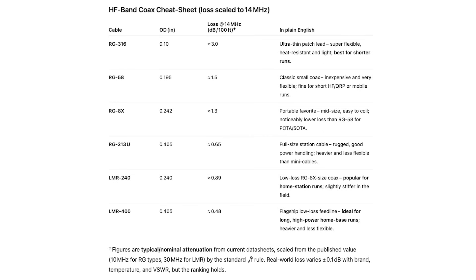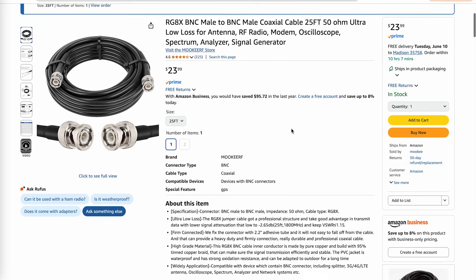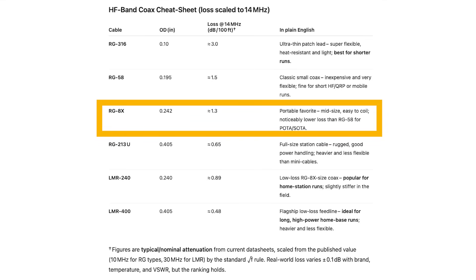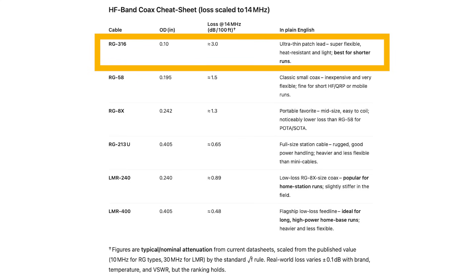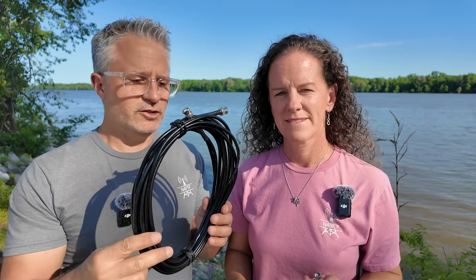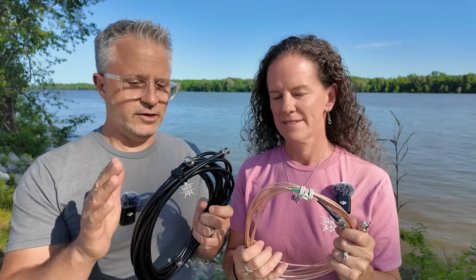On the screen now is a chart of some of the very common kinds of cables and we're going to touch on a couple of them. This is the one we've landed on — this is RG-8X — and it is flexible. It's not the most flexible kind of cable, but it's flexible enough to wrap up and has a relatively low loss — definitely low enough that we really don't have to worry about it; we're not losing very much at QRP levels. This coax is RG-316 and it is really super flexible and easy to take portable, but there is more loss in this one, so we tend to go with the RG-8X. If weight and portability is the ultimate factor, the RG-316 might win, but for us the RG-8X is a good happy medium.